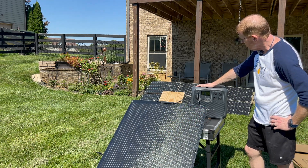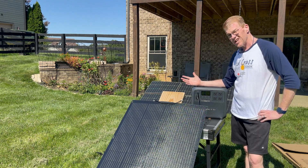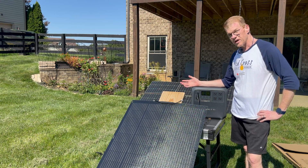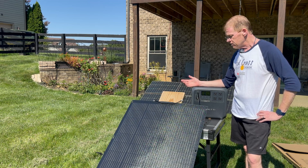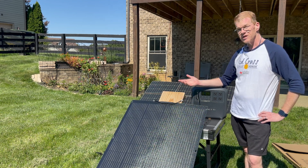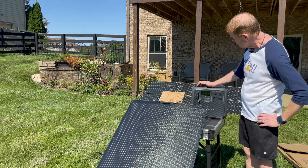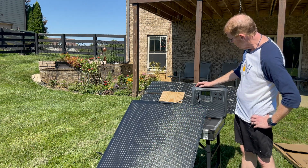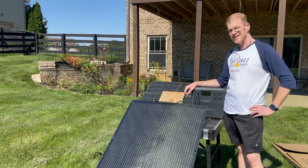Reading 44 watts at 130 volts. My other array today is rated 2,600 watts total connected panels and it's currently putting out 2,000 watts — that's about 76 percent efficiency. If you apply that ratio to the 200 watt panel, around 150 watts give or take is what we'd expect. We're getting 165 watts into the AC180 — that's more than the math would suggest. That's great!